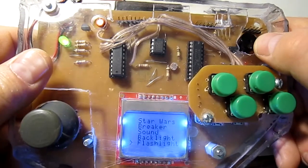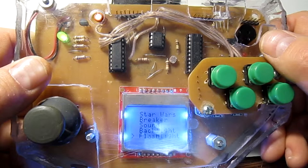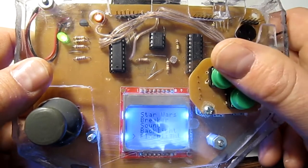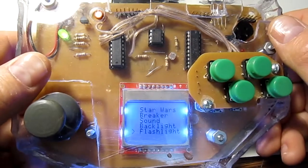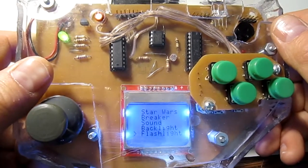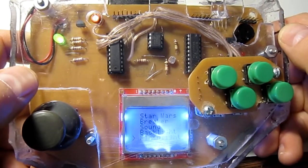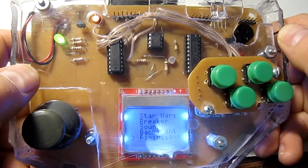This is the speaker. When we want to make a sound, we send a packet of data out to the sound chip and the sound chip handles that sound. No two sounds can happen at the same time, so if we want to make a sound and we're in the process of doing another one, we have to finish that one first.